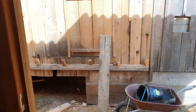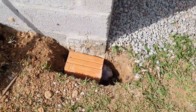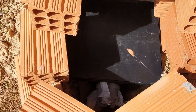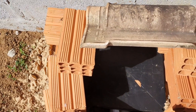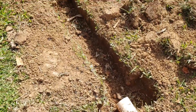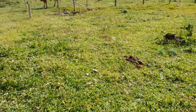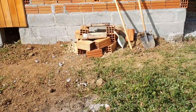I'll just show you outside also - this is something else we've done this week. It doesn't look a lot but it's quite a lot. We've got the water supply there with the bag over it going in. This pile of bricks here - Israel's put them on top of the caixa de gordura, the collector of fat, where all the grey water goes through. He's put the bricks on because he's got sheep and two horses walking around and they'd stand on it and break it. And we've got the drain from the toilet there. Next we're going to have a concrete fossa with a filter delivered - I'll have to dig a hole down there and drop the fossas in and connect it all up.